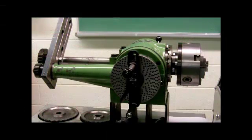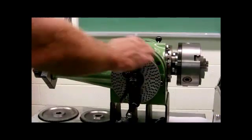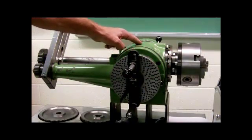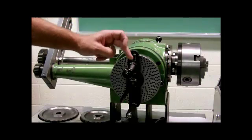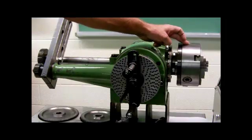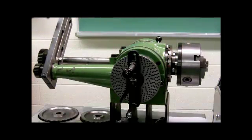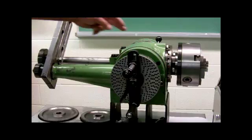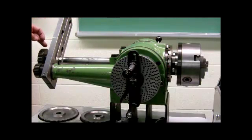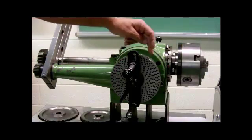Here's a demonstration dividing head set up to show the formula we calculated. We have a traditional dividing head with a crank pin turning over the hole plate, meshing with a worm and worm gear inside, creating a 40 to 1 ratio — 40 turns of the crank turns the spindle one complete revolution. We've put a shaft in the back of the spindle with a gear on it, and we have power coming out of the spindle through a gear train back into the dividing head, causing the hole plate to turn.